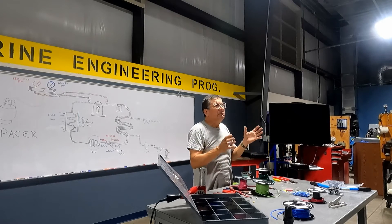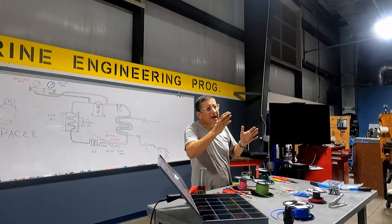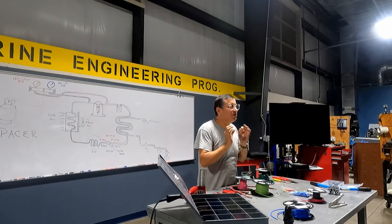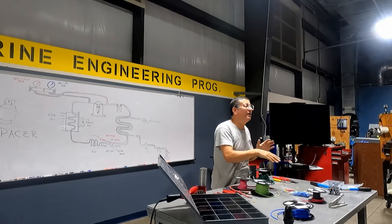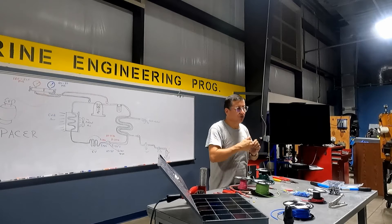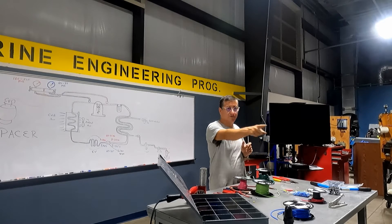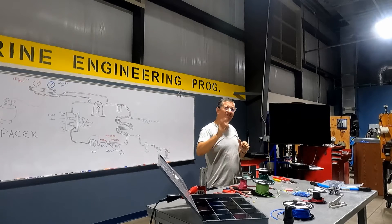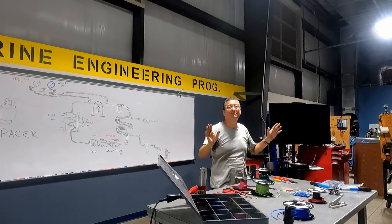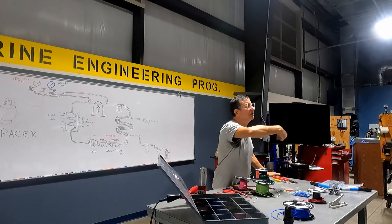If the captain says the radar screen has moving lines, this is corrosion — a bad connection. It's not a problem with the radar or the screen. It's corrosion. That's critical, especially for you captains. In some cases you have the screen with interference — that's humidity. In the electronics course, we are going to practice with all of that.